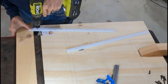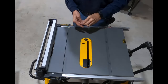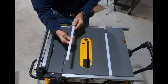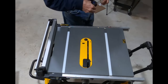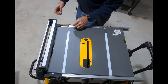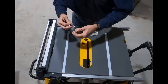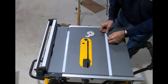The next step was to try to get the runners aligned properly on the board. What I'm doing here is dropping a couple of washers in the bottom of those runner guide holes, and then just putting the runners in — I want the countersunk or chamfered hole on the bottom. I saw a bunch of different ways to do this. A lot of people are using CA glue, but some older videos were just using plain old Scotch double-stick tape — real thin stuff. We'll see if it works. Pretty cheap, and I just happened to have it sitting around the house.